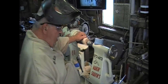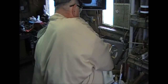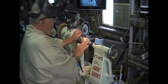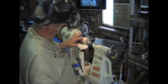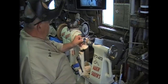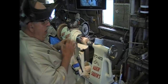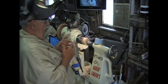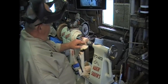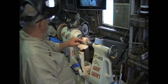I'm going to talk about a little embellishing right now before we get too far down the road. It's all in how you do it, when you do it — it's not unnecessary. Get a little character to your piece. Right now I just knocked the sides down, I got it round. I got a little tear in it but I got some chatoyance, which means it's not all torn up. I got a square bottom on it, and that bottom is going to house this magnet to create the base. I showed you that on a sketch. I'm going to soften a corner a little bit, get that bottom ready, and put a little indentation on the side and burn in some lines to give it a little character.